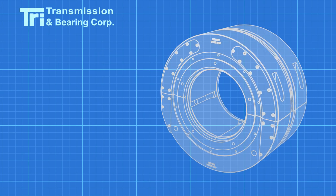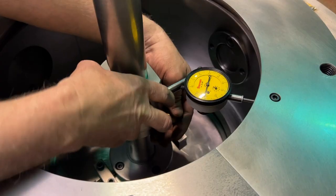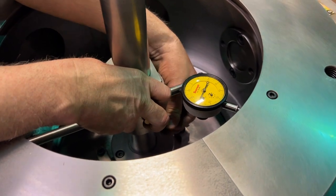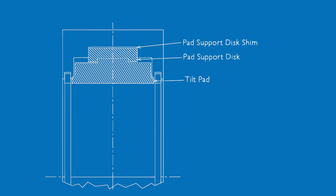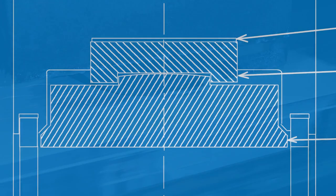The TRI bearing is different. The assembled clearance is determined before being installed. The bearing is assembled on a fixture where the internals can be precisely measured. Pad support discs with backing shims determine the assembled clearance. They have flat surfaces and are easily ground on a surface grinder to achieve the proper distance from the center of the bearing.